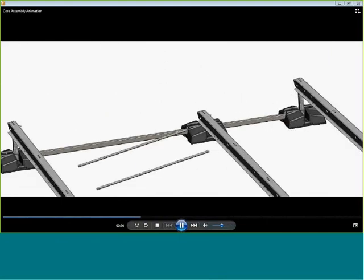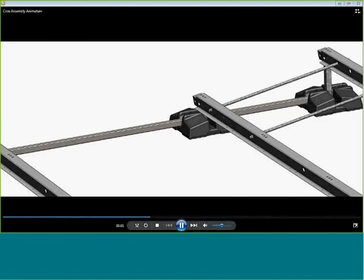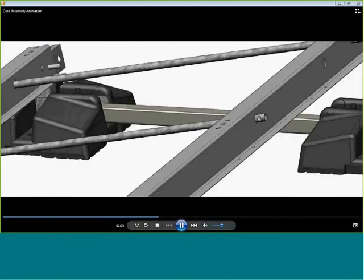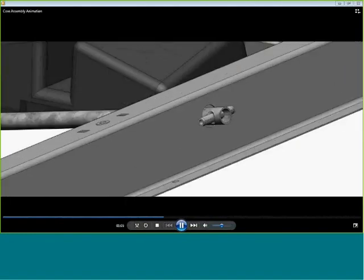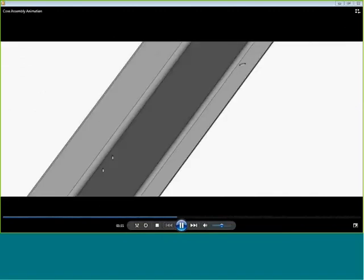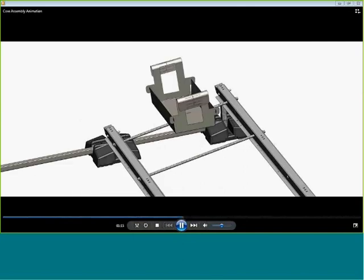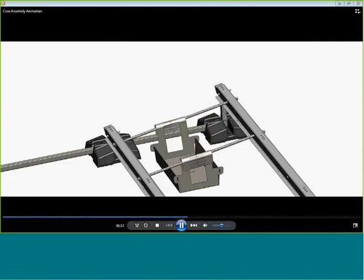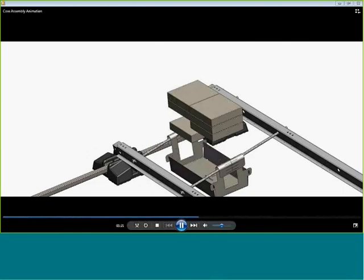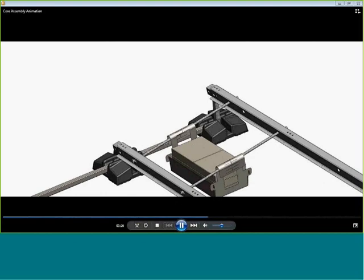For a ballasted system, the ballast pan rods are going to slide into pre-punched holes in the rail. And those are secured in place by hammering a spring pin through each end of the rod. Then the pan drops onto the rods before bending the flanges of the pan over the rod and securing with a nut and bolt. Then you can go ahead and place your ballast in the pan.